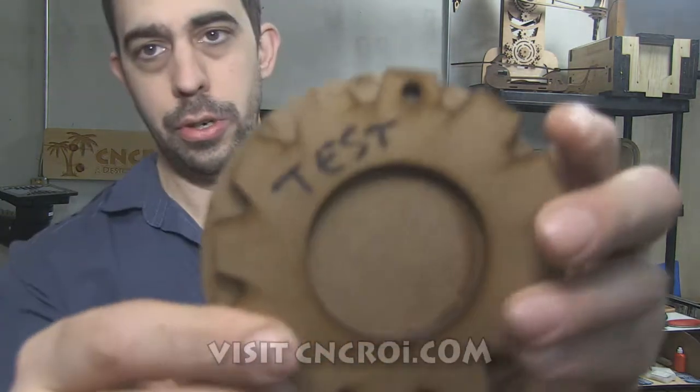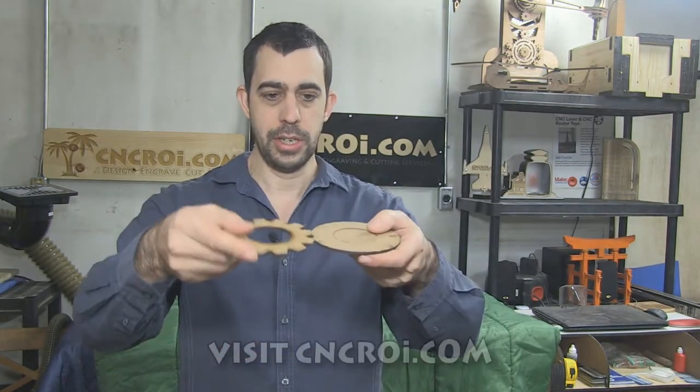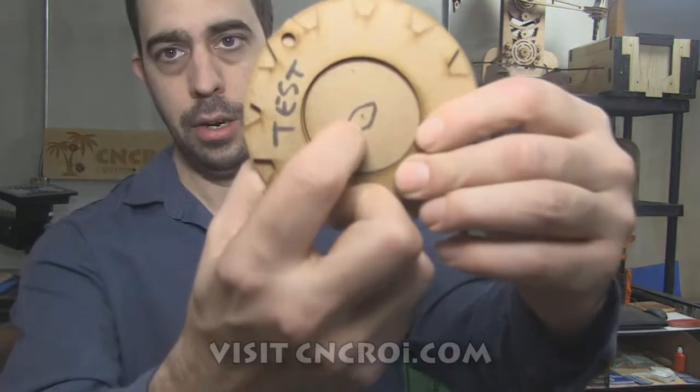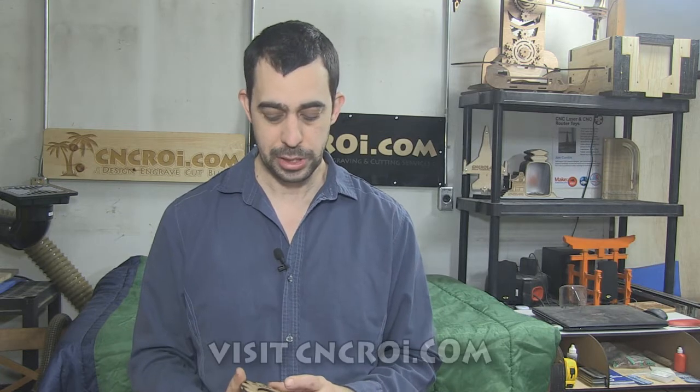Here's another reference — this circle is just a little bit bigger than the gear. So when I put some scrap material, it's all different shapes and sizes, and I just lay it out here. You'll notice there's a little dot, which I made a little circle of — this dot is the center point. The nice thing about my laser is that I have a two-way feedback system, unlike my router and other equipment in the shop. What that means is I line up my laser to here and I know I can cut this shape out perfectly within that area. This is incredibly efficient using small little jigs like this — they more than pay for themselves in laser time because it allows you to use material that otherwise would have gone to waste.